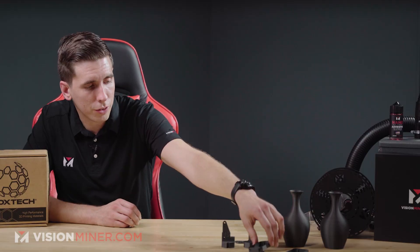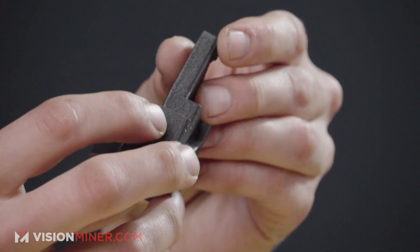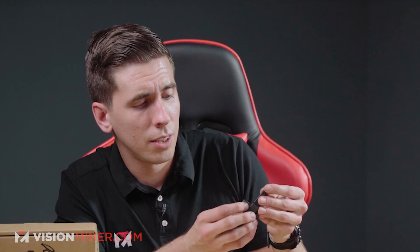Compared to Markforged, they have the most beautiful carbon fiber nylon parts, but you can get the exact same quality with almost every nylon — specifically PA12, PA6, and this HTN stuff really works well. We've also got a manufacturing jig from one of our customers printed in every material to show the exact differences. Beautiful surface finish, good dimensional accuracy, nice details. With open material systems, it really just comes down to your tuning and slicing on your particular machine and hot end geometry.